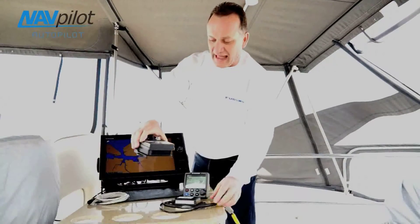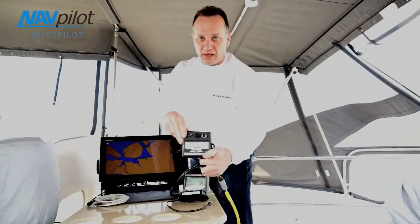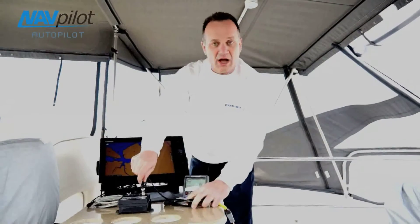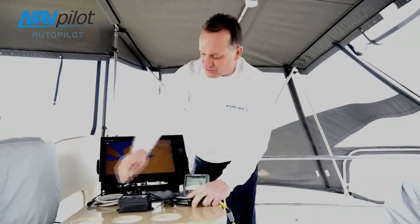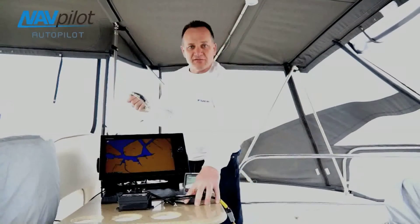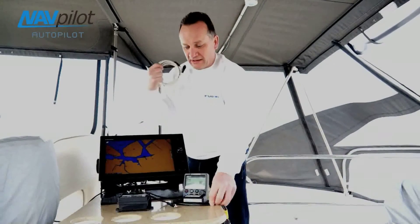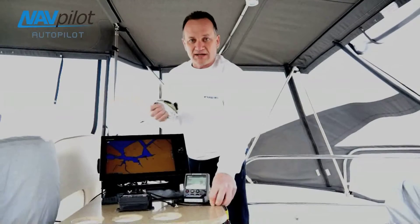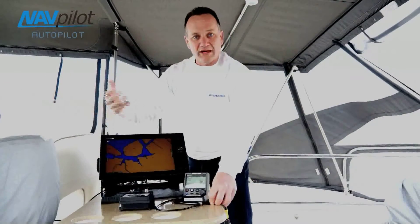What we'll do then is we'll just add our IPS interface — this is a Furuno IPS interface that you'll get when you actually buy the Volvo Penta NavPilot 700 system. What you'll do is you'll take what's called this gateway and plug it into the CAN bus port on this little IPS computer. Once we do that, we plug that in and we supply power from the ship's mains into this system and run this other cable over into the NavPilot 700 series processor, and that's the total installation. There's no more than that. All the engine information, all the rudder information, all the steering information is supplied through these three components into our processor unit, and we're done. So that's the basic installation of the system besides the autopilot control head and the processor unit.